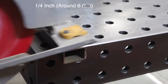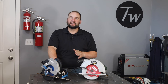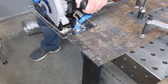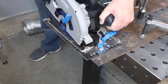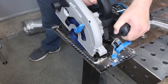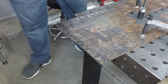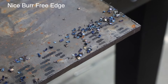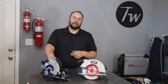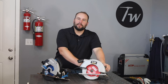Let's move on to some quarter inch thick steel plate — that's really what I picked this up for, to have a good option to cut material right around an eighth of an inch to a quarter inch thick. I'll start with the Evolution saw, starting back at the edge and moving my way along. You can see it's cutting at a pretty good rate getting through this quarter inch steel without bogging down at all. The cut is only going to be as straight as I can hold it, and it would be better with the guide it comes with, but this will be okay for today.